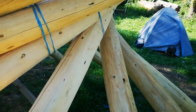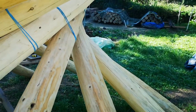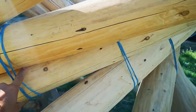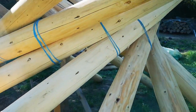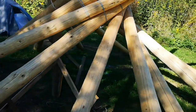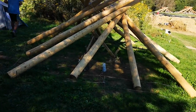Instead of being behind each time — as you can see here, the contact point is behind the one before — between these two beams the contact point is here, between the following it's here, between the following it's here. So always the contact point is behind the beam placed before it. But this time the beams do not follow the same pattern because of the contour of the wall, so we'll have to dismantle the last beams in this area, something like half of the wall.